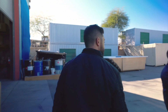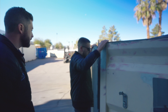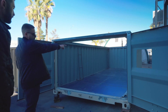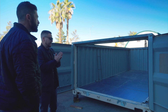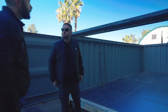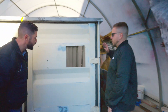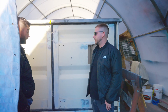Let's walk around to show you inside one of our containers prior to it going into the paint booth. We add structural support to the fiberglass shell — those are called saddles — which gives the fiberglass an area to rest on and protects against deflection. The walls will be painted and insulated, and this container will be coated with resin. We keep the vents on the sides but remove all the hardware and strip the paint down prior to painting.